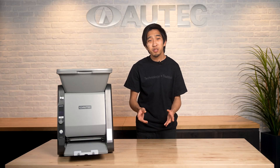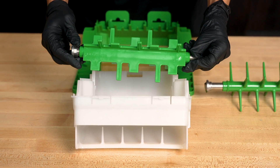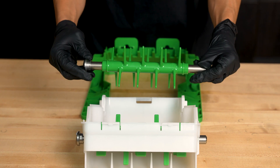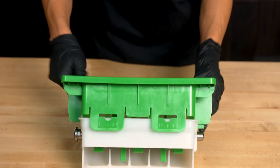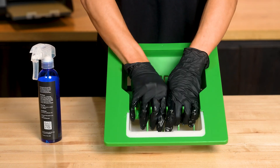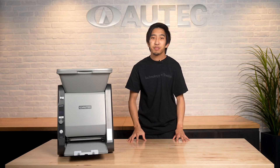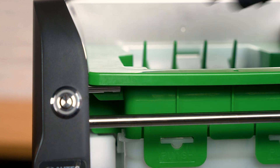Next, reassemble the hopper base. Orient the body of the hopper base so the lower opening is facing you. Install the stirring shafts into the U-shaped grooves with the wider end on the left-hand side. Stirring shaft A, which has a wider and flatter appearance, will install into the grooves closest to you, while the spikier stirring shaft B will install into the grooves further from you. Align the slits of the back portion of the stirring stopper with the grooves on the hopper base, then lean it downwards for the front hooks to click into place. With the stirring unit fully assembled, apply an even coat of Autex oil onto all the inner surfaces, including the comb guide and the stirring shafts. Place the hopper base into the main unit by inserting it from above, bending the large ends of the stirring shafts into the stirring joints on the left-hand side. Ensure the stirring stopper rests on the metal shaft in front. If it's not, try rotating the stirring shafts for the gears to align inside the stirring joints.